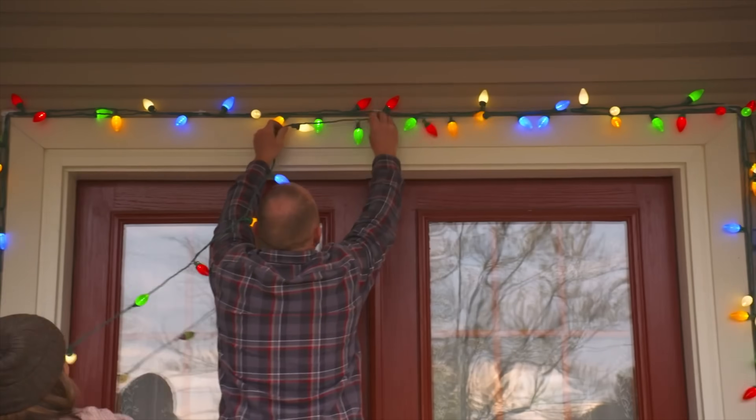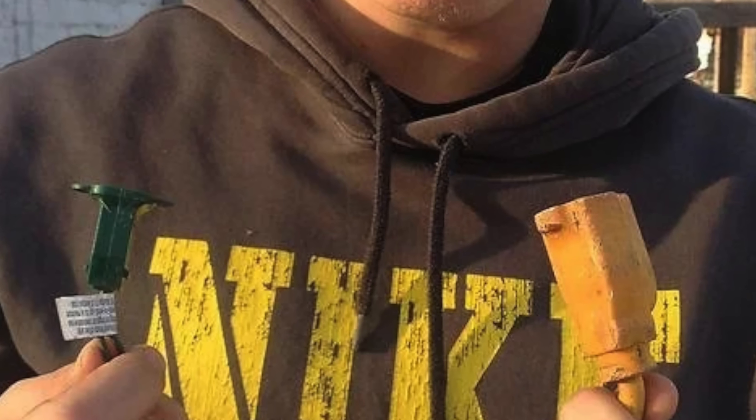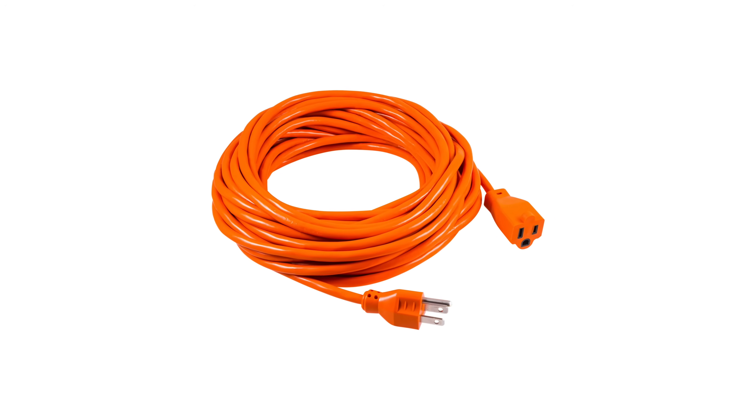Here are the two reasons that people try to use this incredibly dangerous cable. Imagine you're hanging up your Christmas lights and you get all the way to the end of the string and you realize you've hung them up backwards — now the female end of the string is the one by the outlet. The solution seems obvious: instead of using a male-to-female extension cord, use a male-to-male one, and you'll be able to power those lights even though you hung them up the wrong way. That would probably actually work — but is it worth the risk of someone accidentally zapping themselves because you have 120 volts sticking out of this cable? Of course not.